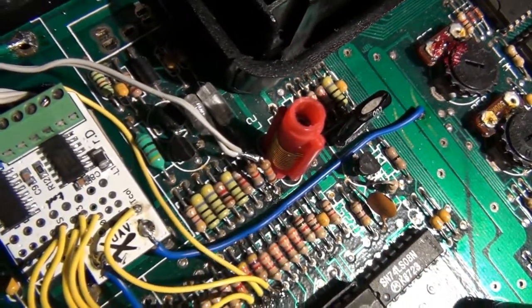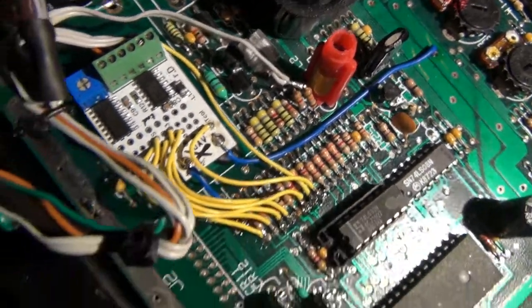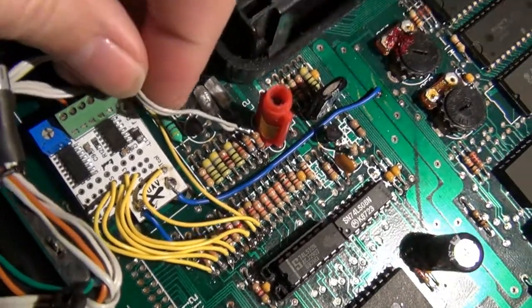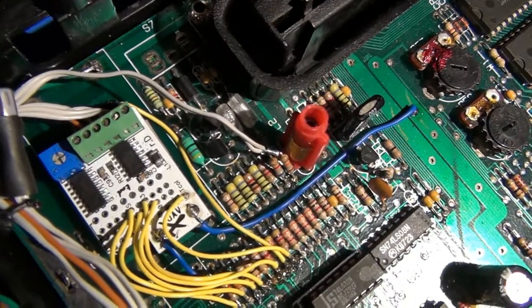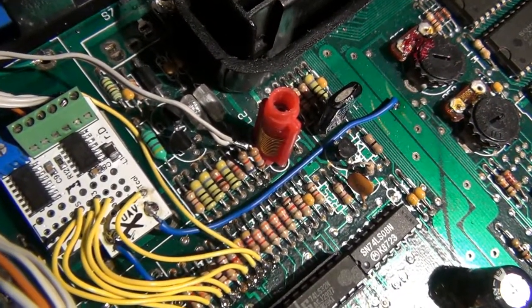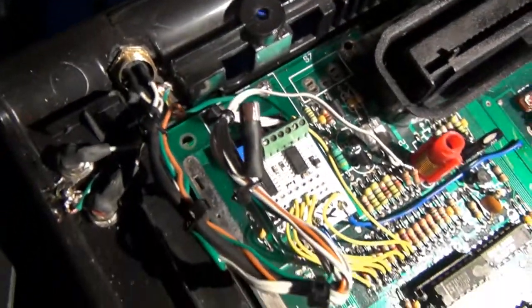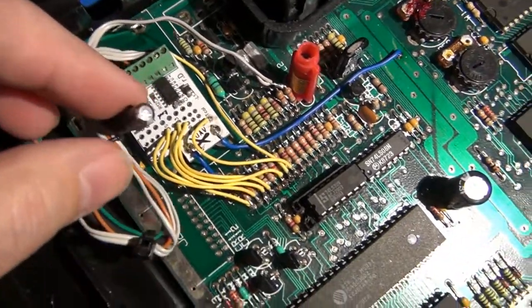Lift them up, solder them together and then take your wire. You could use one. I actually have two. I have both a left and a right, which are just wire dual mono. But you just take the two leads and you just solder off at the end of those two resistor points and run it to a capacitor for filtering.